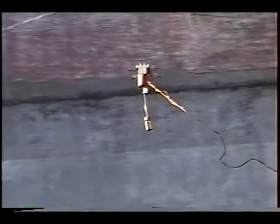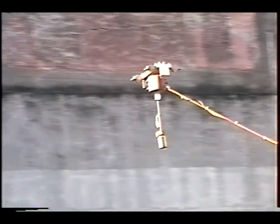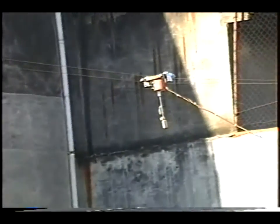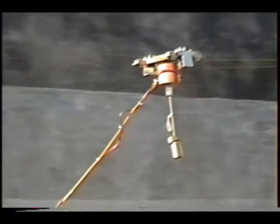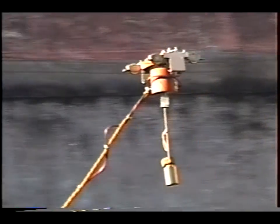By this time, the collector was very improved. The contact with the wires was made through carbon inserts fixed between the pulleys on each side. Another improvement was the rotating apparatus in the lower part to prevent the cable from being twisted when the trolley car negotiates the turns.